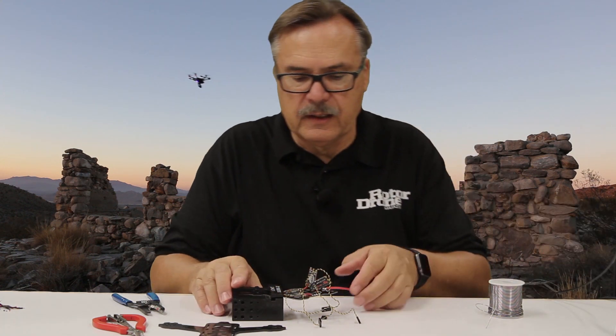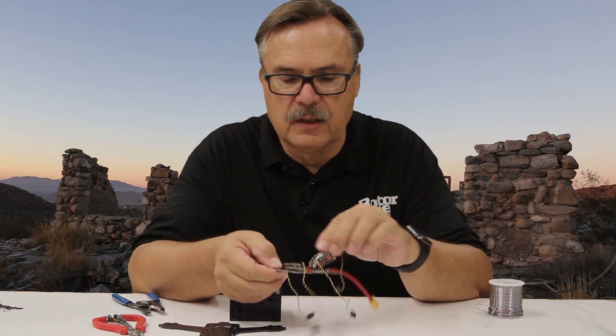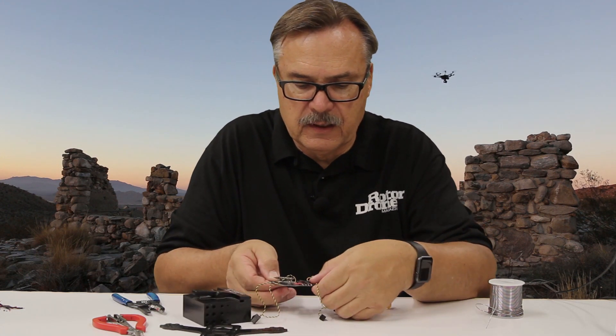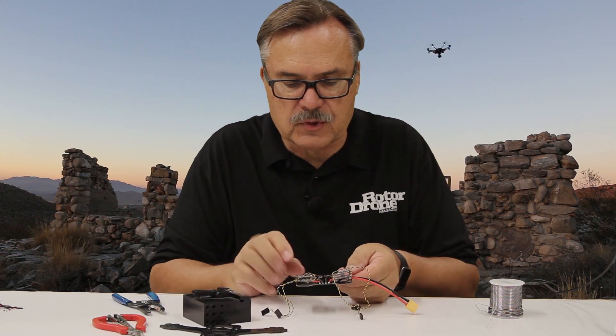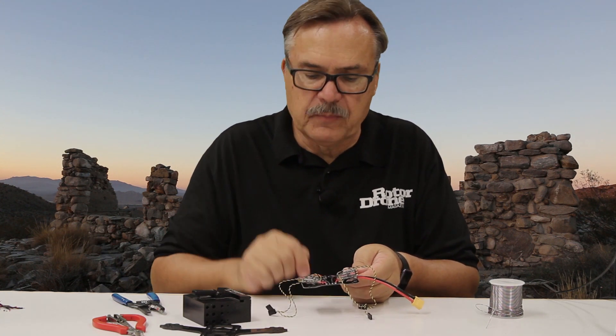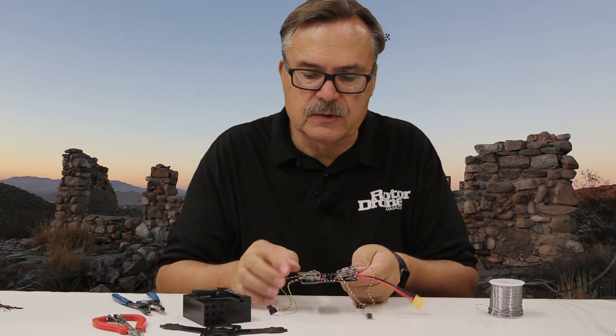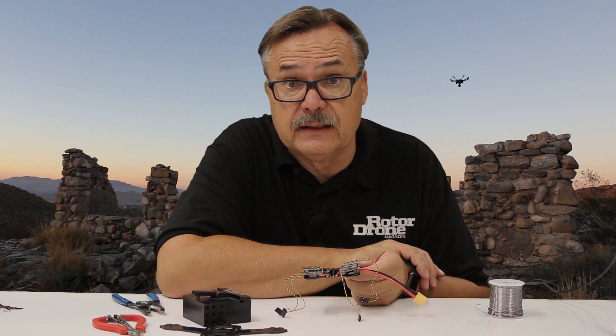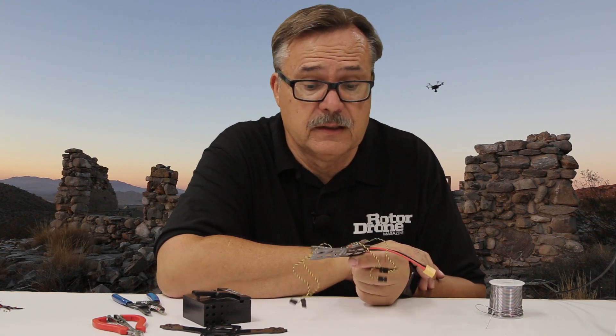You can see that when you have everything ready, you can get your board together relatively quickly. Everything's still a little bit warm, so I'm not going to push it all down yet. But now you're going to be able to mount this on, set up your motors, and then solder your motors onto all these little tabs right here. And that's basically an introduction to soldering onto the power board.